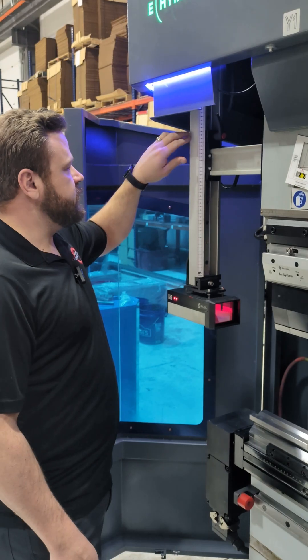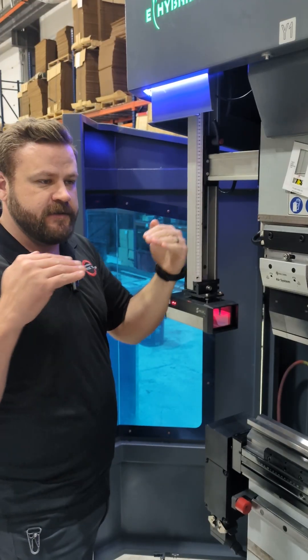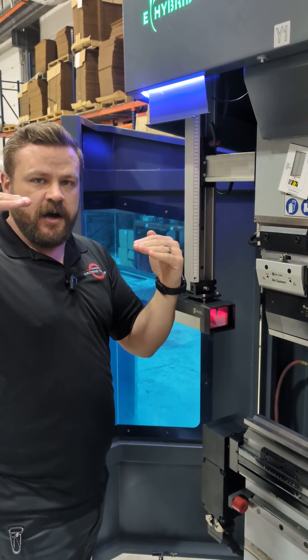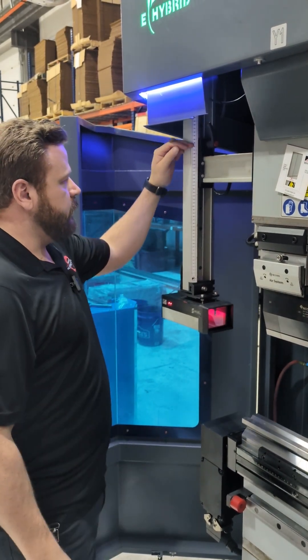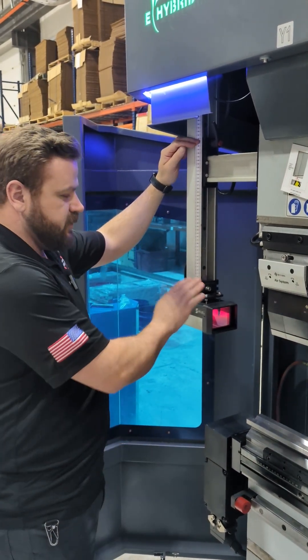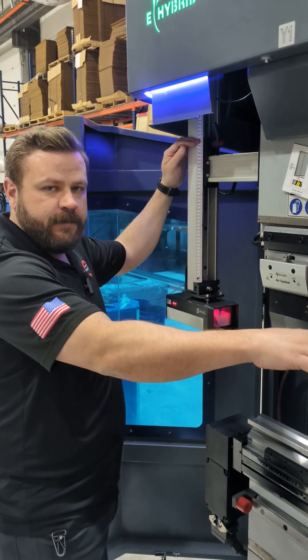In your lasers, it's good to come up and look at your scale here. A lot of times you'll see your lasers are actually uneven and they're shooting upwards towards the receiving end. You want to make sure they're roughly around the same distance, and you can make adjustments here to shoot a straight beam across your punch.